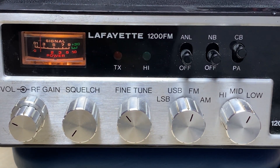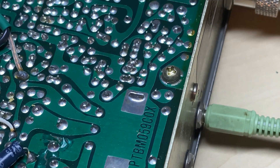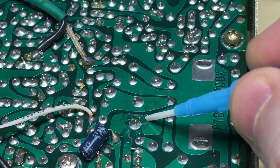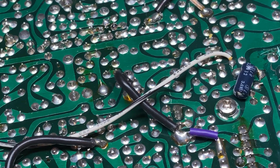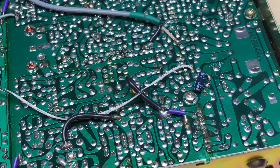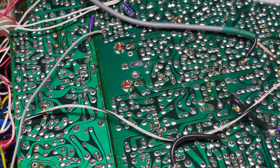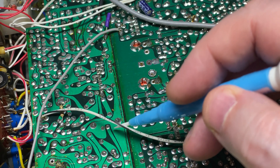See if we can find some voltages that are wrong somewhere. So I took the lid off and immediately seen this - one of the main smoothing capacitors has leaked and gone through the board, lifting up the green solder mask. We can deal with that no problem.